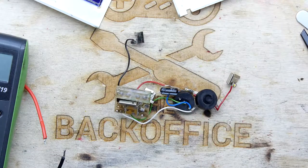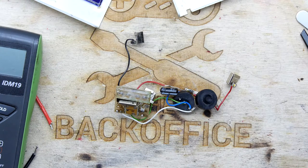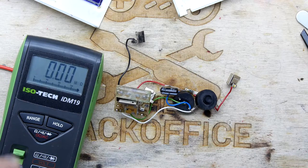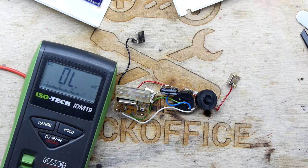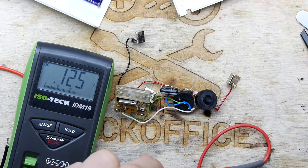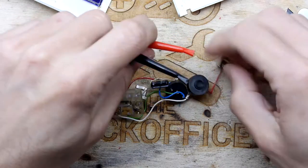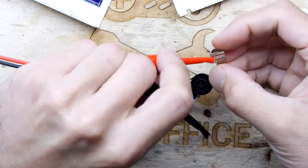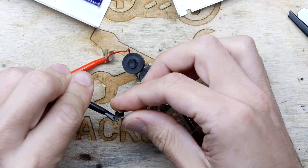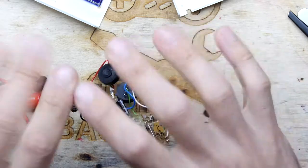And that's it — that's the Sinclair mess. I've got some crocodile clips from my bench power supply, again ridiculously short bench power supply leads. Before I hook that up, I'm going to hook it up to my meter — better safe than sorry. It's going to be hard to get spare chips for this thing, if not absolutely impossible. They're probably unreliable back in the day when they came out. So we've got 2.9 volts, pretty happy with that. I'm going to turn off the power supply because these things are a bit weird and a bit glitchy-sensitive.